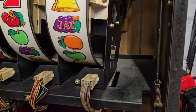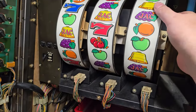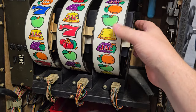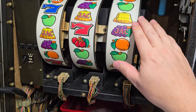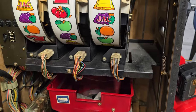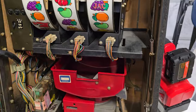These ones here have to have some sort of feedback loop. So while they feel like steppers, they're either closed-loop steppers — which means they've got feedback someplace that tells it where it's at — or it is a servo motor, which means it's got constant positioning. You can feel it's kind of jittery when I rotate it; that's going between the poles inside the motor. That's how I know it's a stepper motor.